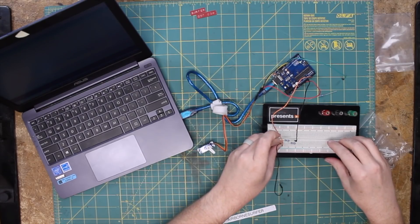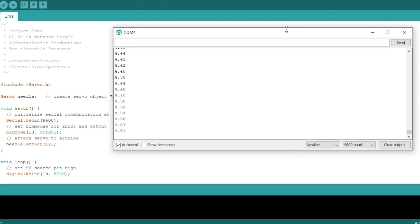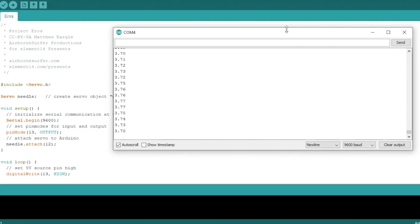Now for a live test — just me, so I plug in. The needle is a bit floaty at about 4.5 volts with full deflection and very little resistance. Licking my fingers gets it to about 4.8 volts — slightly better. Using a 10 megaohm resistor to simulate a second person, I'm seeing about 3.7 volts on that connection. It works, showing variable output based on resistance.